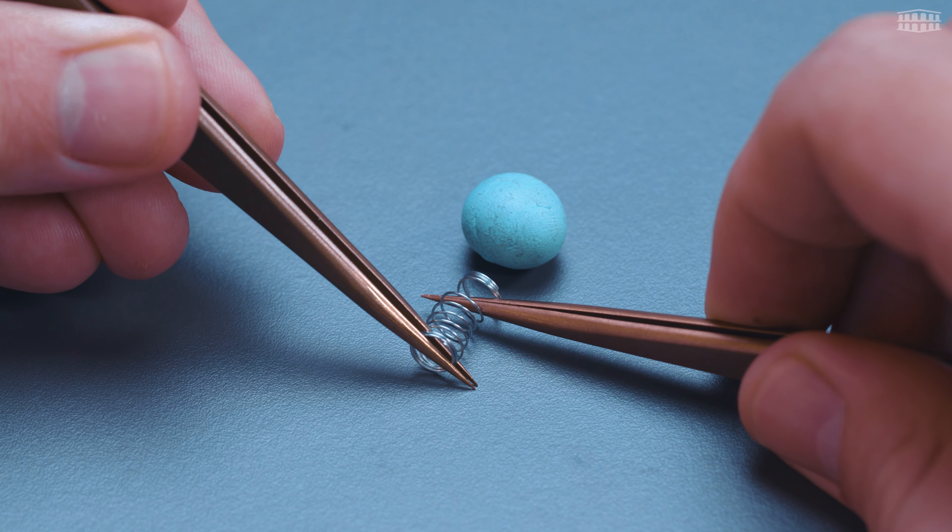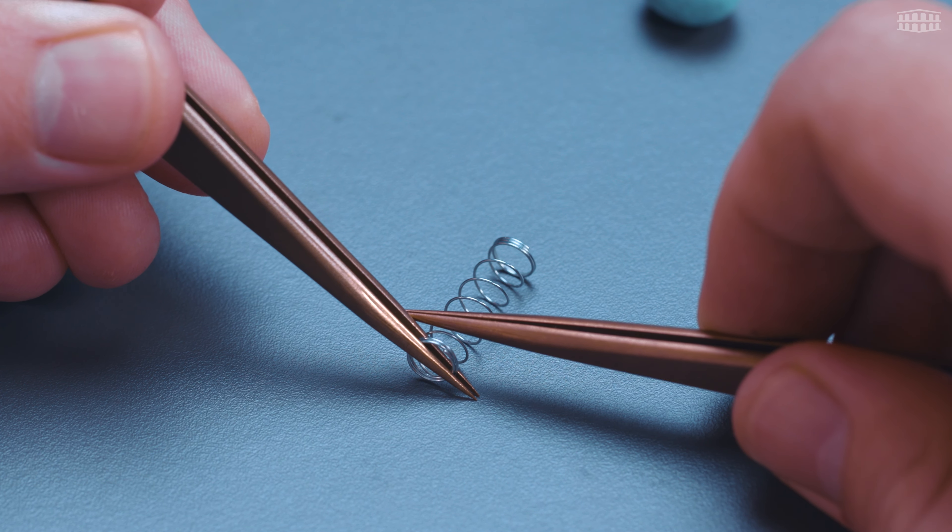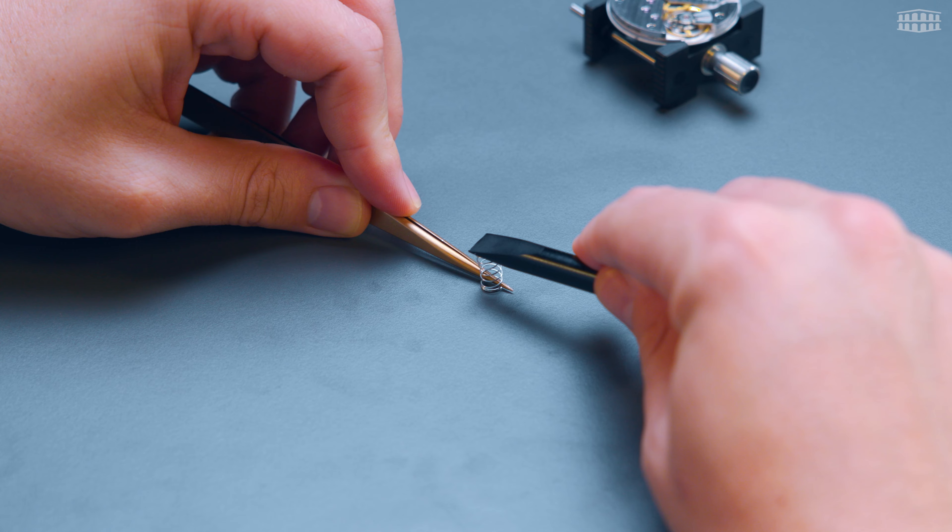In all cases the total amount of energy remains the same. But it changes forms and moves from one place to another, and this is what we actually want to achieve within a mechanical watch. We want the energy you exert when turning the crown to transmit to another component, so that eventually this component will put something else in motion. In order to do that, we need a way to store this energy, and one approach is to create tension through a spring while we compress it or twist it.